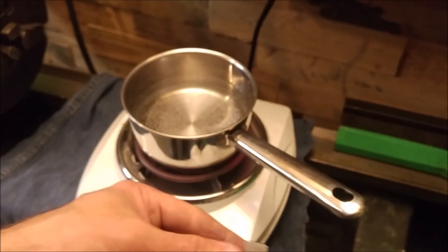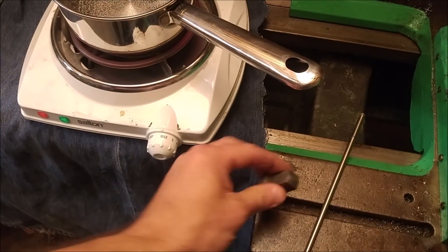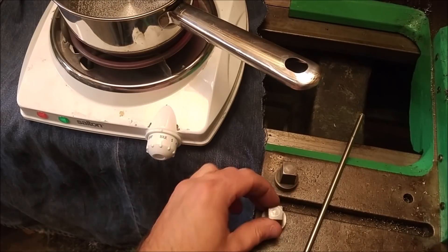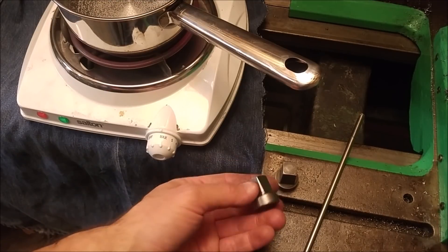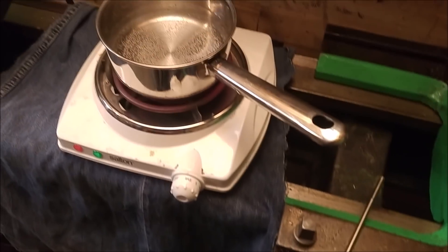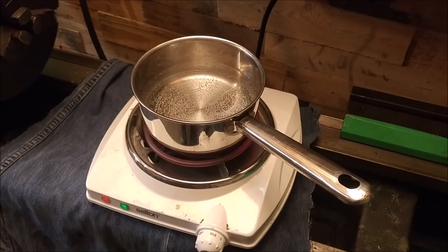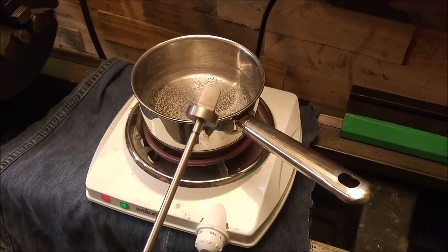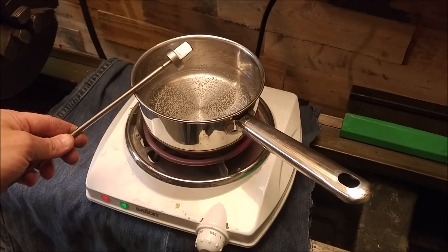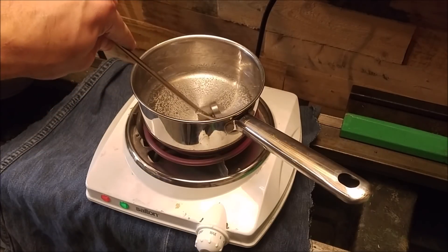This colouring I really like because it matches the original lathe really well. If you go with a bright finish it sticks out like a sore thumb, so I prefer to have something with that patina on it. The process I use is hot vinegar. Some people use this process for etching blades — it's a mild acid. If you leave this overnight it will do the exact same thing, but if you heat it up to boiling point you can do that within two minutes.